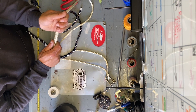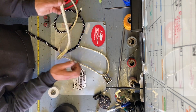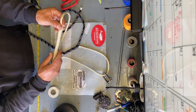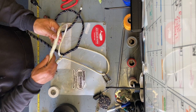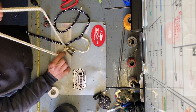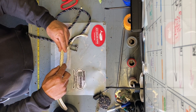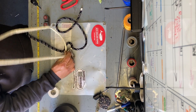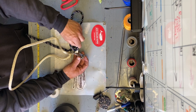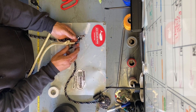It's a great all-around line — this one is going to be a halyard for an Ericsson 27. Go nice and easy; I'm squishing the core up a bit so it balloons and I can shove the fid in. You can see how it fattens up like a snake — just milk it down, keep going until it's all gone. Then put the cover tail through and the shackle's sitting right where it should be.